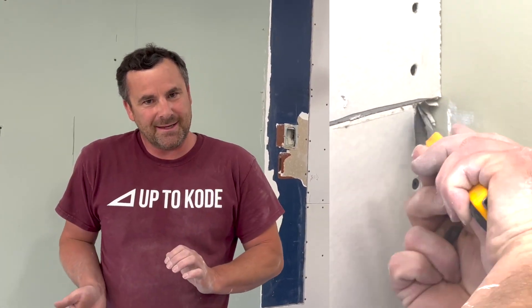Number eight is cut off broken corners. This happens if the drywall is just a little too tight and you give it a little extra nudge — it's not plumb but you can't beat it into place. You'll see loose paper, which means the corner is busted out. Cut it right out of there and use Confil to pre-fill it, because if you use regular mud it's going to take five days to dry. Confil will cure as a chemical cure in a couple of hours — wipe it tight because you can't sand it.